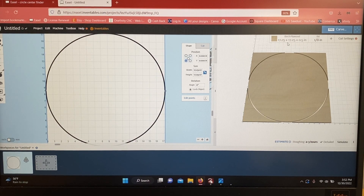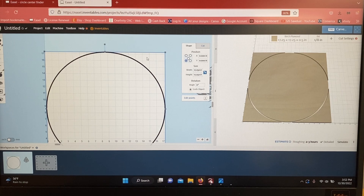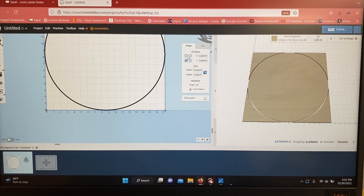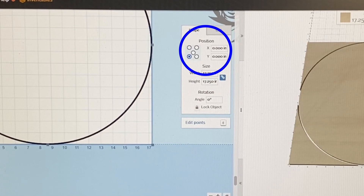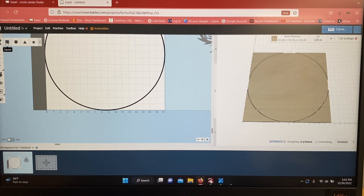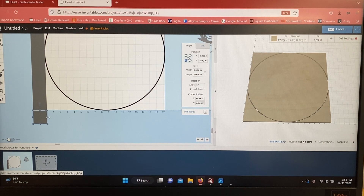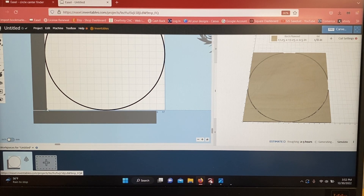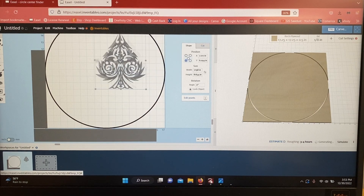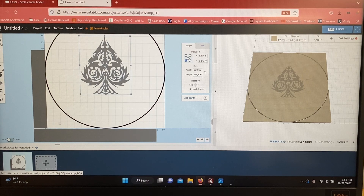As you can see, I've got my material set up here for 17 and a quarter by 17 and a quarter — that's this box here — and the circle indicates the actual blank. I'm running my file from the lower left corner. You set your XY zero at the corner of the jig on your work surface, bring in your file, and run it from there.